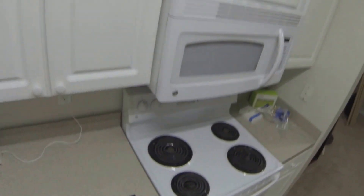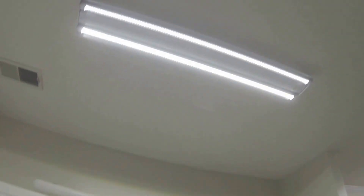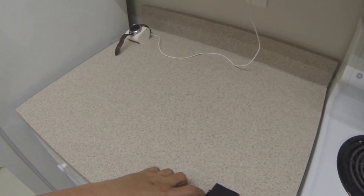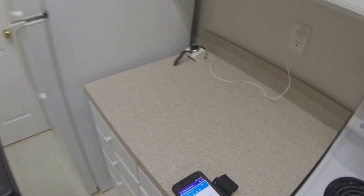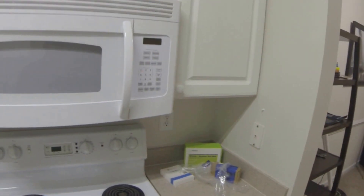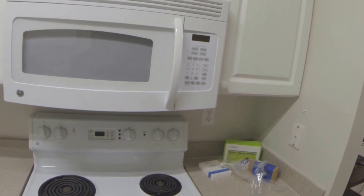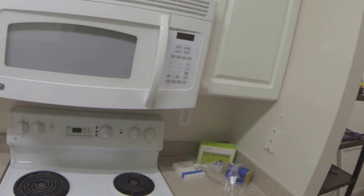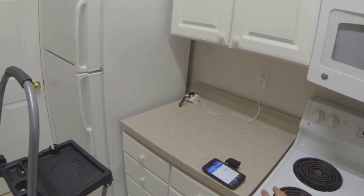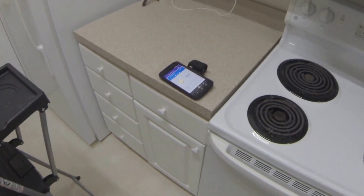Wow. And that is a good, clear, clean white light. So we had about 210 lux on the phone. Now we've got 400 lux. So we replaced two bulbs — 40 watts each — so a total of 80 watts was putting out just over 200 lux. A total of 36 watts of LEDs are putting out 400 lux.